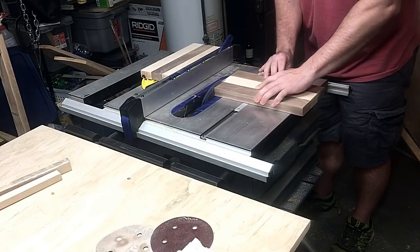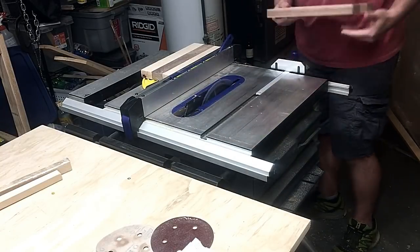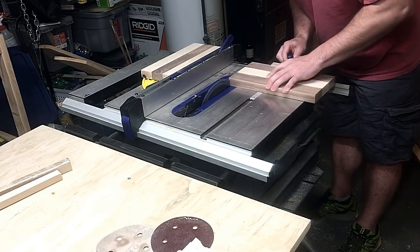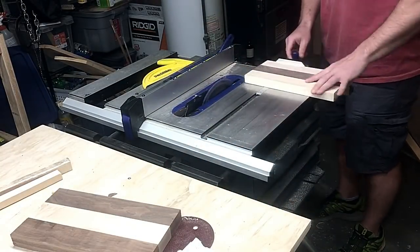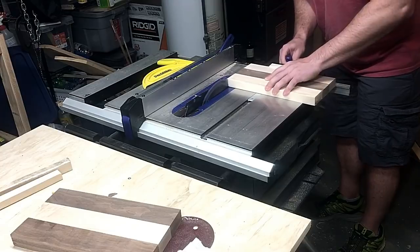When sanding was complete, I cleaned up the sides back over on my table saw. I recently coated the table saw surface with some finishing paste wax, and it really helps the wood slide easier, especially when making cross cuts.